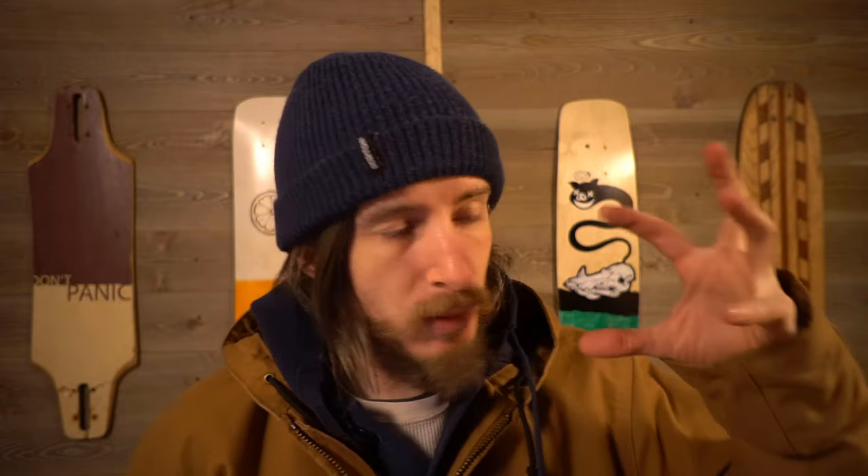Hey there, it's Chris from Good Roads. A question I get a lot on the channel is why do I use a pressure pot to cure my urethane when I'm making wheels and bushings? The quick answer is it eliminates bubbles from the material. It compresses any bubbles down and dissolves them, leaving you a solid block of urethane that makes for a stronger, more structural part.